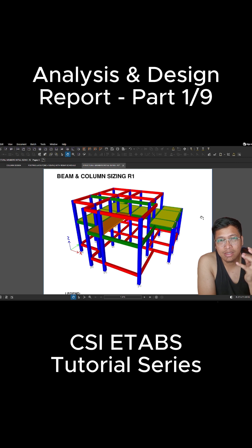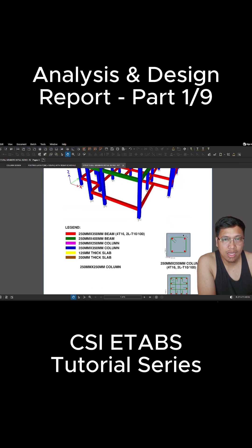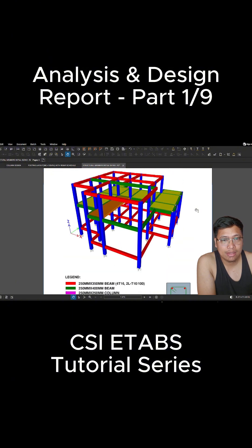For example, for columns, depending on the size, I take the maximum forces and consider them for the design and sizing of each element. I have design tools — I use Extract X Pro for design. Although you can design directly in ETABS, you can also check it manually because there may be failures even if it passes in ETABS.